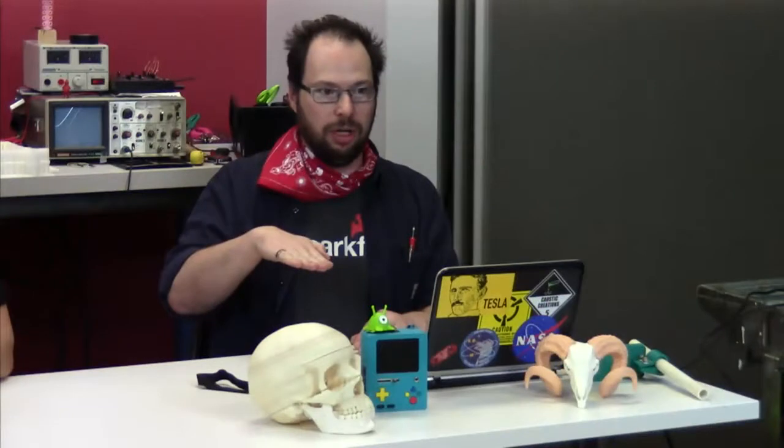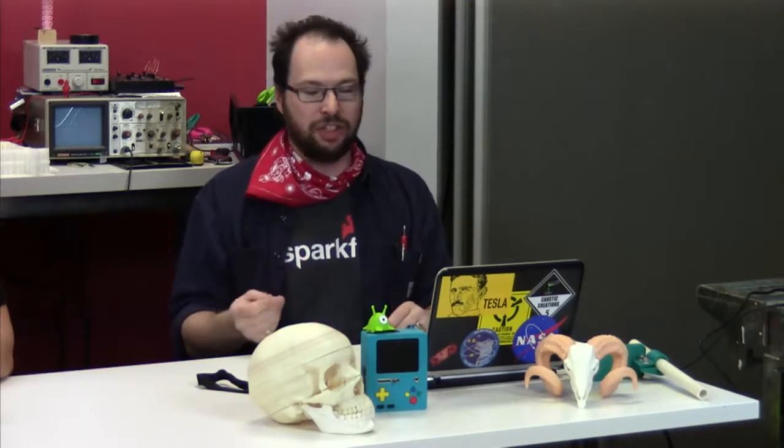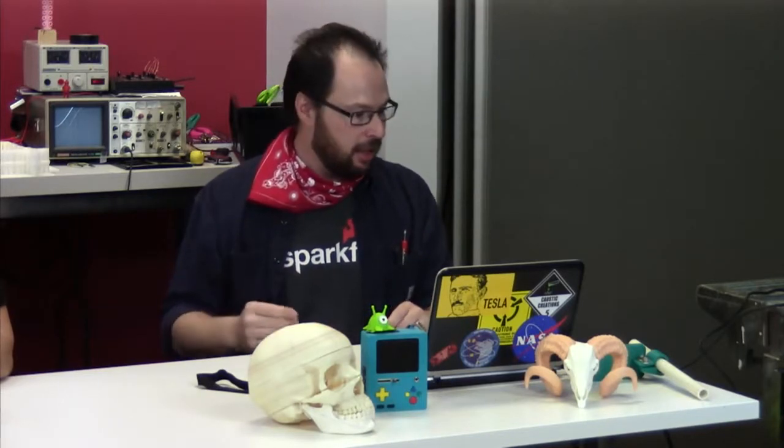The most common is the extruded cut, or the extrude or the cut, which is basically taking that profile that you draw and extending it into the third dimension. Another way to go about that is if you take that 2D object and you revolve it around an axis, you can make round objects like drive shafts, axles, things like that.